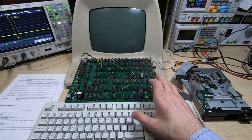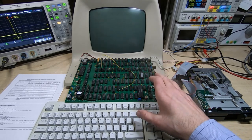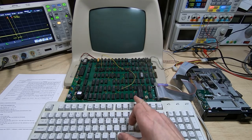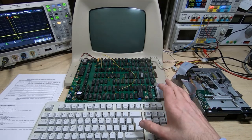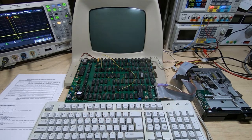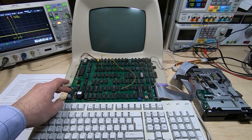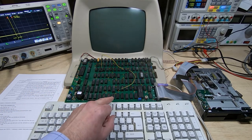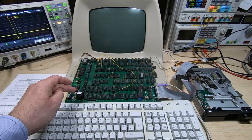The tests I carried out in the previous video all seemed to pass quite well - it did seem to behave itself. I have since fitted the remaining floppy drive interface components. I've got a floppy drive plugged in. I have not tried powering this up yet with the floppy drive attached. I've also fitted the LEDs over on the left here, and these LEDs are used to indicate the status of the floppy drive and DMA control latch - the same latch that was previously used on the floppy drive interface.